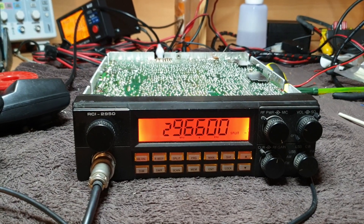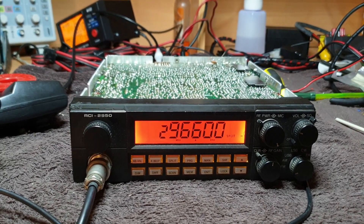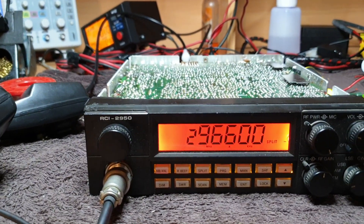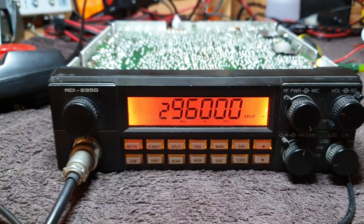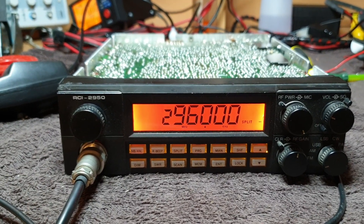You can really do a lot with these little radios. We'll get the power up on this part of the band - I can almost put money on where the power will be centered at the moment, but we'll fix that. There you go - transmits, does what it needs to do. Hopefully we can get a few more watts out of this just on 29.6 FM, and we'll be pretty happy with it. There you go - an easy fix over two parts to a radio that had no receive and no transmit.